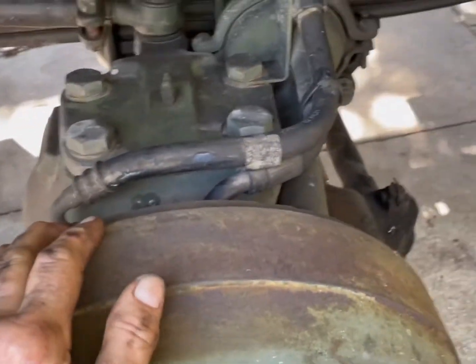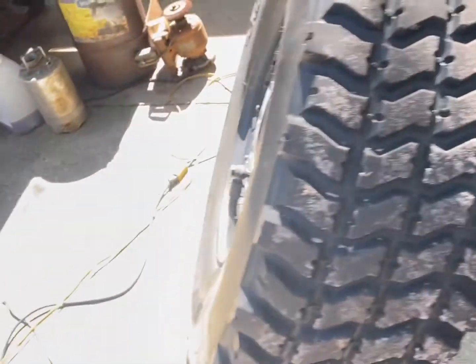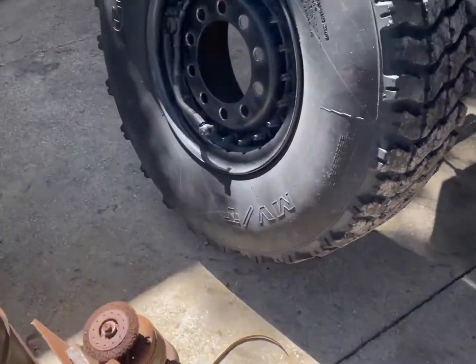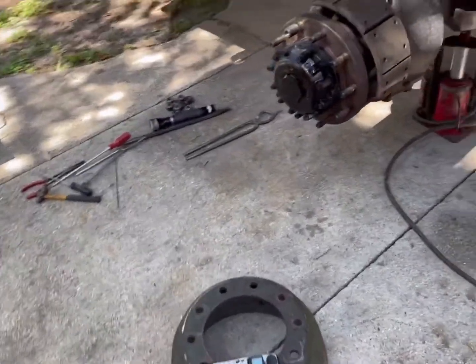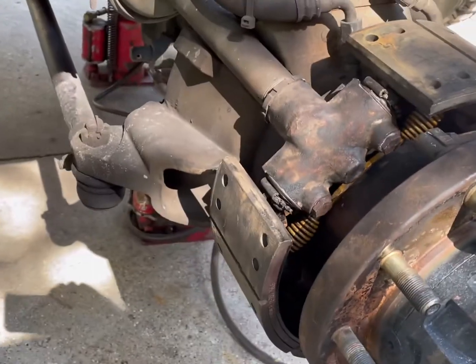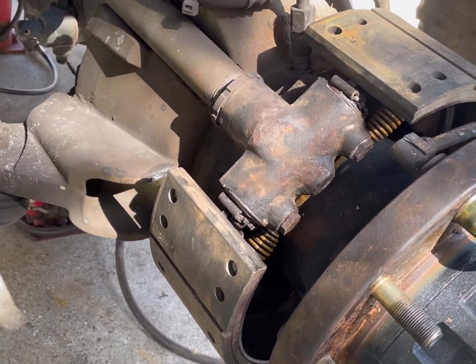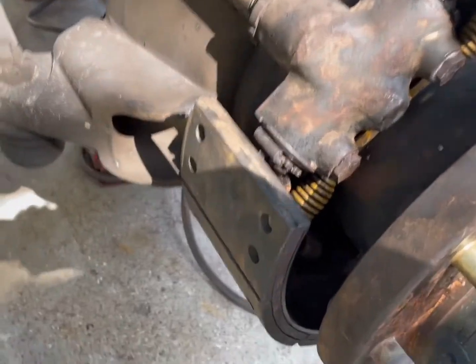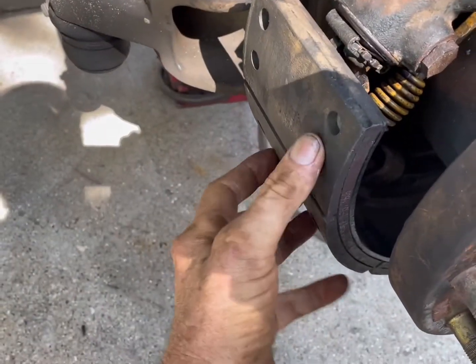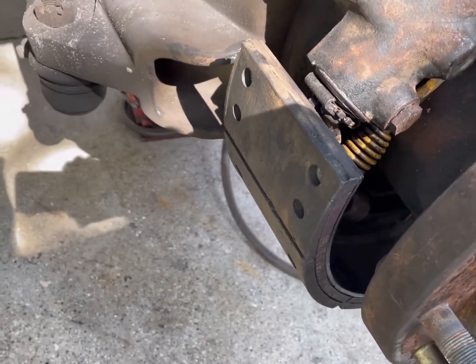To adjust your brakes, like I said before, you manually turn out those pieces. To coin an old saying, righty-tighty, lefty-loosey. The fact of the matter is, on these adjusters, if you turn them clockwise, yes, clockwise, they will go in. That's a right-hand turn. That tightens it in. That sends that in, thus causing your brake shoes to be less close to the drum. So you want to turn these counterclockwise.